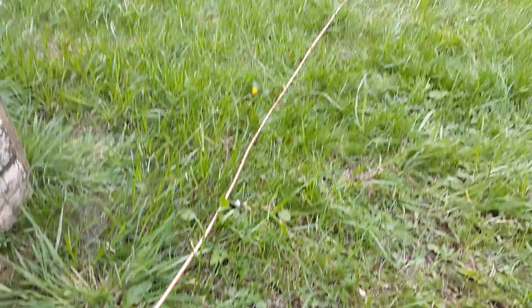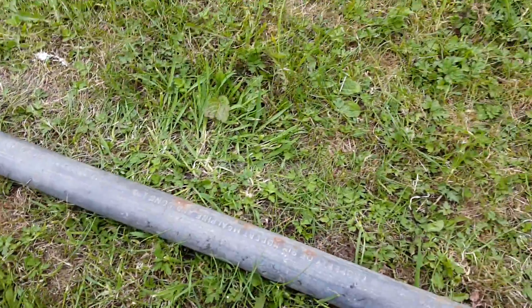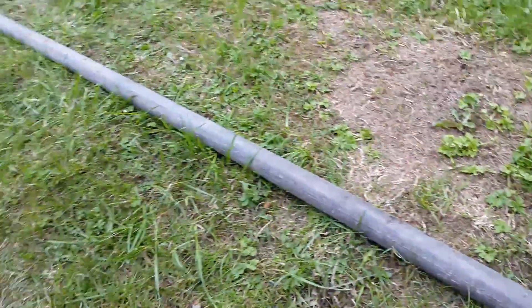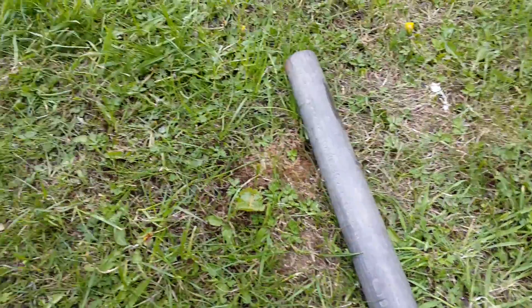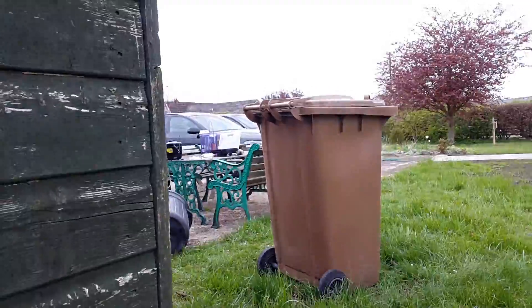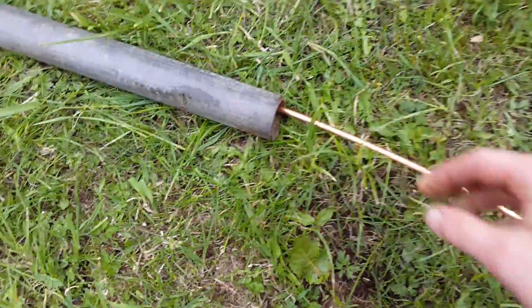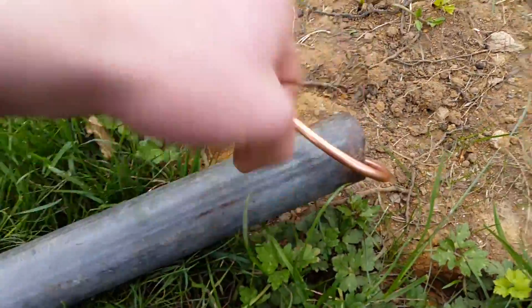The best way to make your coils is to straighten out the tube along the ground and then wind it around — this is a steel pipe which I'll wind it around. What you need is just any tube that's going to permit the finished coil to fit inside the water filter housing. Start by getting a good tail length, put it down inside, then bend it around and begin winding. Getting it started can be quite difficult but you just need to get it around and start winding it onto the tube.